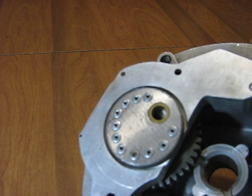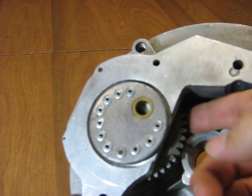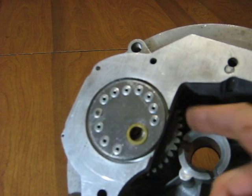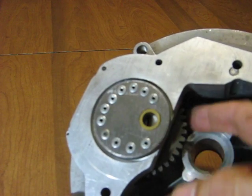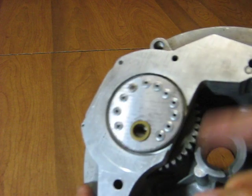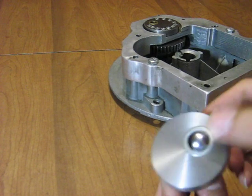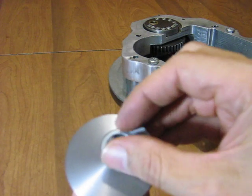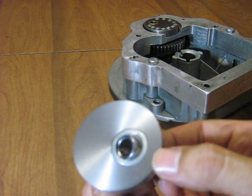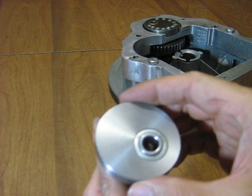In this video I'm showing the sleeve drive shaft and drive ball, off an earlier version of the sleeve valve engine. The bevel gear goes to the crankshaft and just spins around in a circle. There's a ball joint here that drives the sleeve. Another view of another sleeve drive shaft shows it actually has a COM6 ball bearing in it. The shaft comes out and there's a little stub shaft that comes off the sleeve.